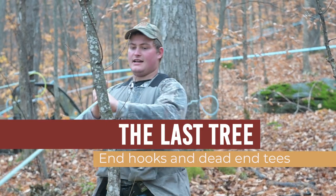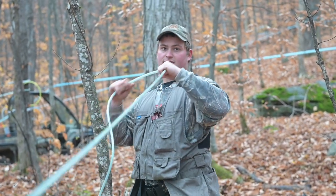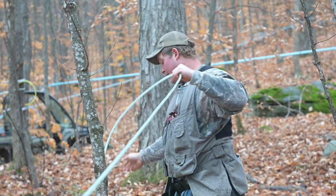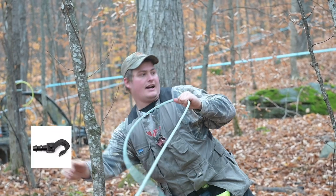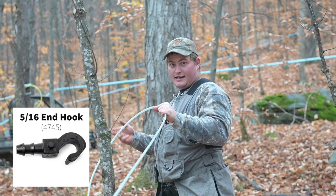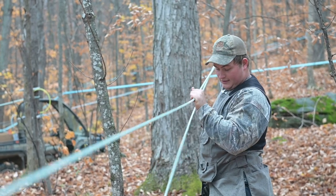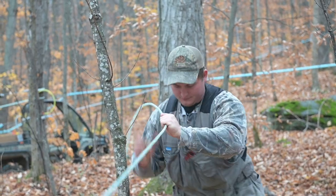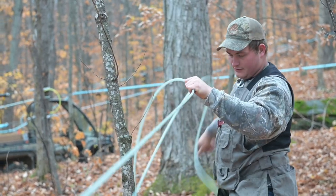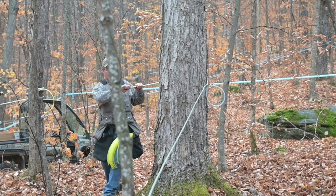Where your last drop is a red dead T, the last part of the loop is all non-vacuum because it's all plugged off. You have those hooks, so say I had a branch down right here — I don't need to splice that or cut it up, I just need to unhook it, bring it back through, and there we go.